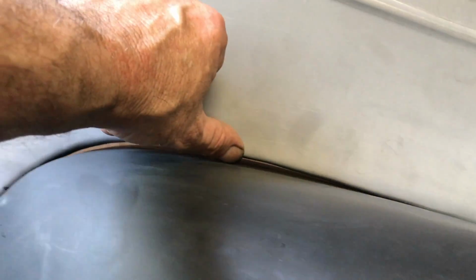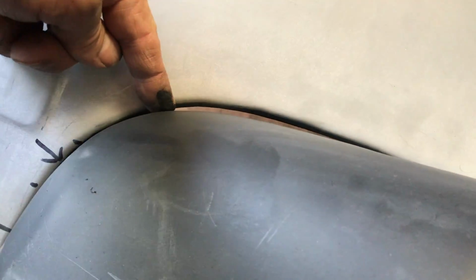Well, let's have a look at the other side then. And the clamps are doing a good job there, I must admit. And here's that gap I'm talking about, and it will pull in. You can see there's a step in there, goes along, and this comes out for the step. So it's technically perfect. It's the steps in exactly the right position. It's all logical. It's about 5 mil, maybe it's a little more than it should be, but in hindsight, oh no, it sort of needs to be there. And this will clamp in here, and then that corner's not too bad, so it's actually probably going to work all right.